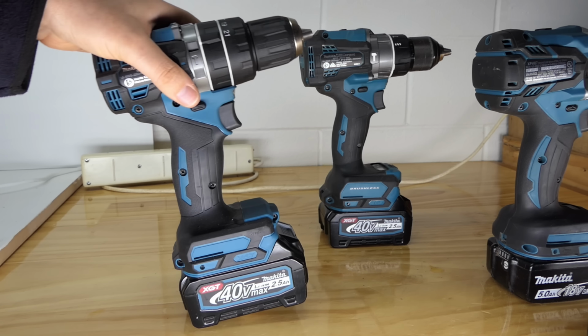100mm batten screw, highest clutch setting. Let's go. Same again with the high-end model this time. We've got it on the screw setting, 41 down here on the clutch. As you can see, much more power. This one can't even do it. If you need power, you've got to go with this one.